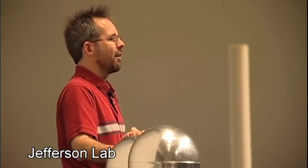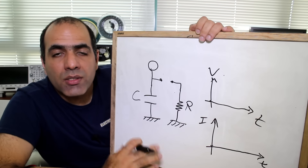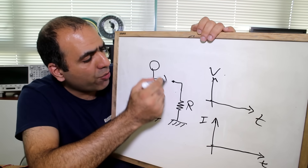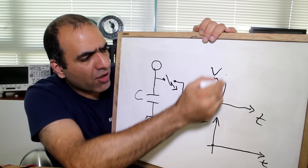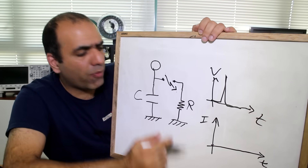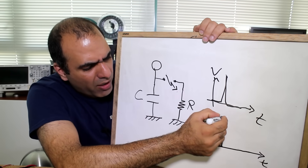It's a pretty good presentation though — go watch it, link in the description. The current through my body would be very high: if my body resistance is around 5 kilohms under high voltage, for 200 kilovolts there would be a 40-amp spike of current through my body. When the capacitance of the machine shorts to my body through the arc, the entire voltage of the capacitor falls across my body, but it drops quickly to zero with a time constant of R times C. For the same reason there will be a huge spike of current that quickly goes away.